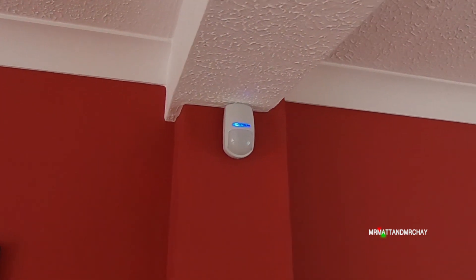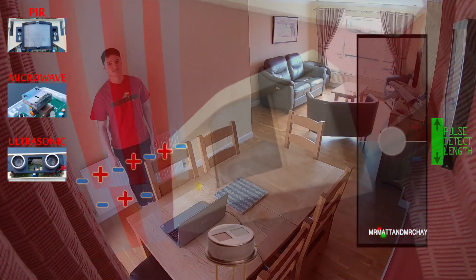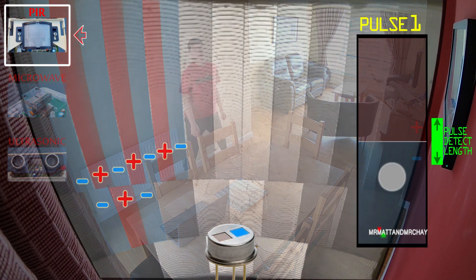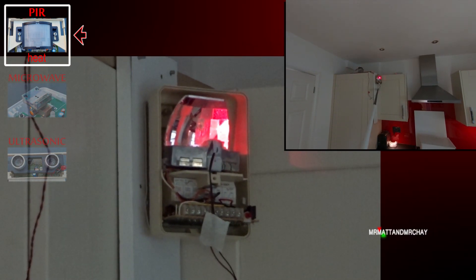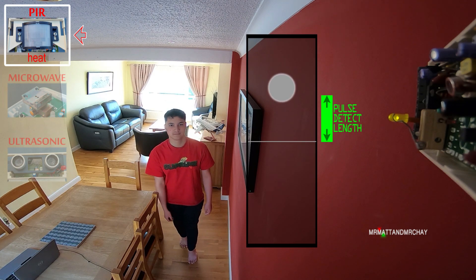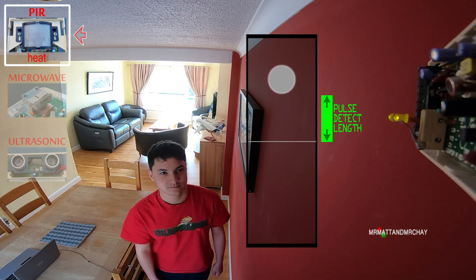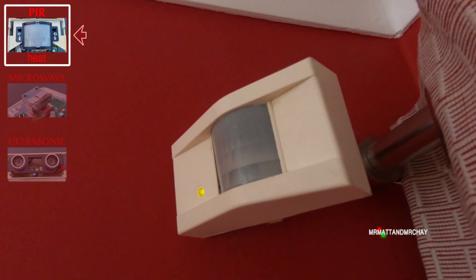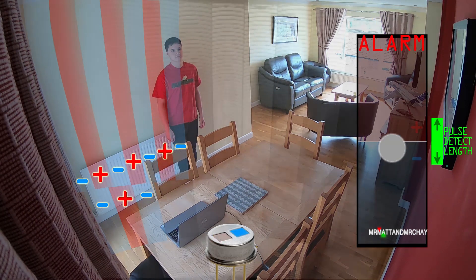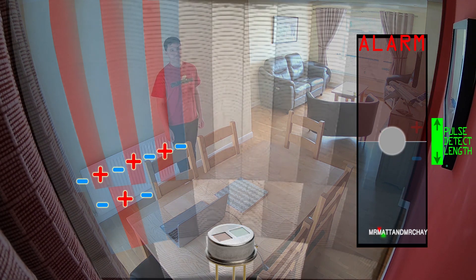Here is a quick overview of how a PIR works. A PIR works on a heat principle — more specifically, detecting infrared energy emitted from everyday objects. An important part of a PIR is the lens, which divides the room up into segments. The pyroelectric sensor detects sharp rises and falls as the object moves around, helped by the segments of the lens.